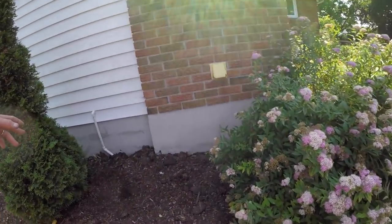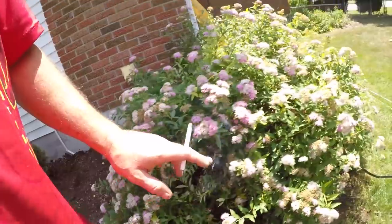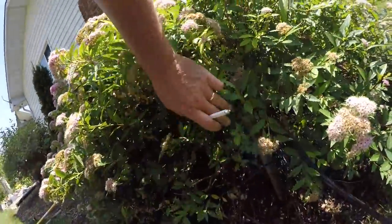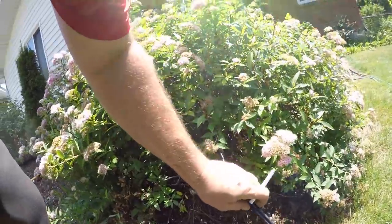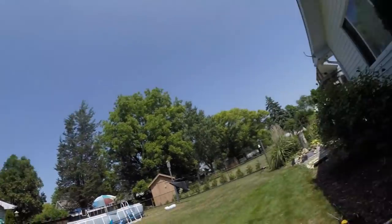So I didn't want to dig 3 feet down right here, boys, so I used conduit, eh? I ran conduit all the way out, right to this post, boys, that I put in. So I'm gonna put the box on the post here, and then I can plug the trailer in there in the wintertime. Decent.